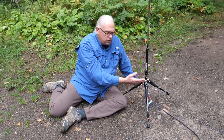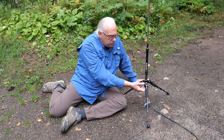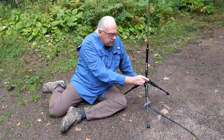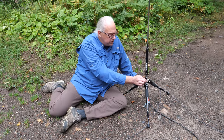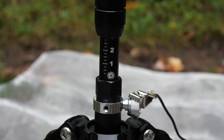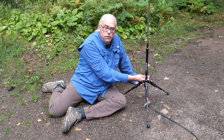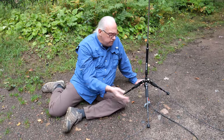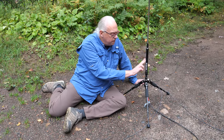I've seen some antennas with UHF male connectors, so that's a nice option. Both antenna mounting sections come with the tripod. Finally, there are screw holes around the base that you can attach your counterpoise to. This antenna does not come with any counterpoises, so you'll have to make your own radial wires. Right now I'm using four 16-foot wires. It also works with a window screen — I tested it with the screen and was able to get a good match with both the wires and the screen, which is a really good sign.